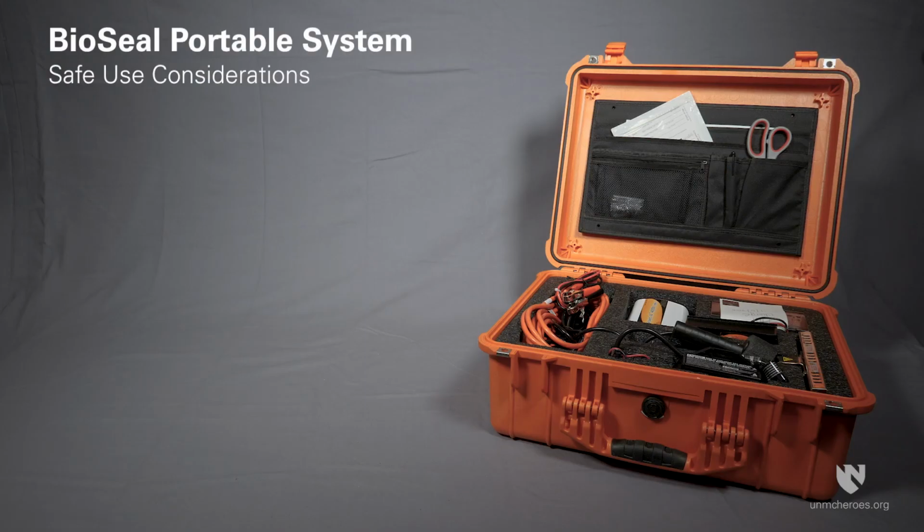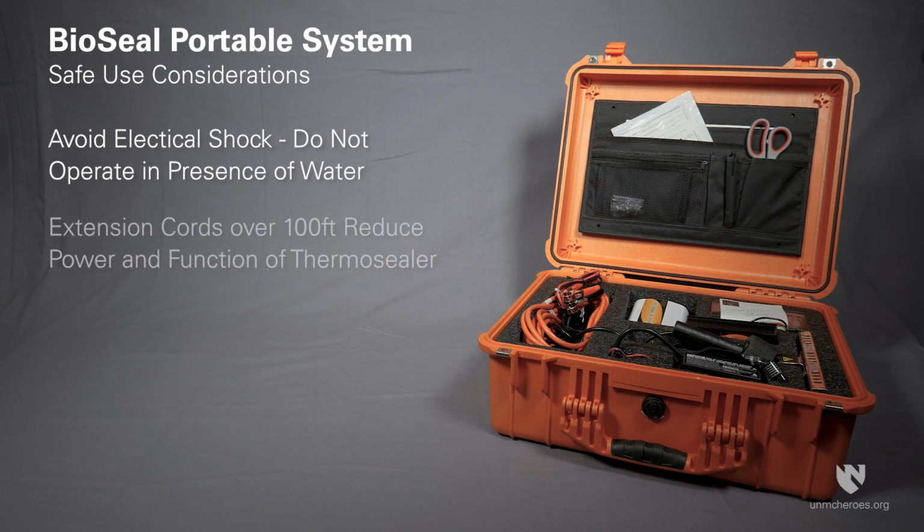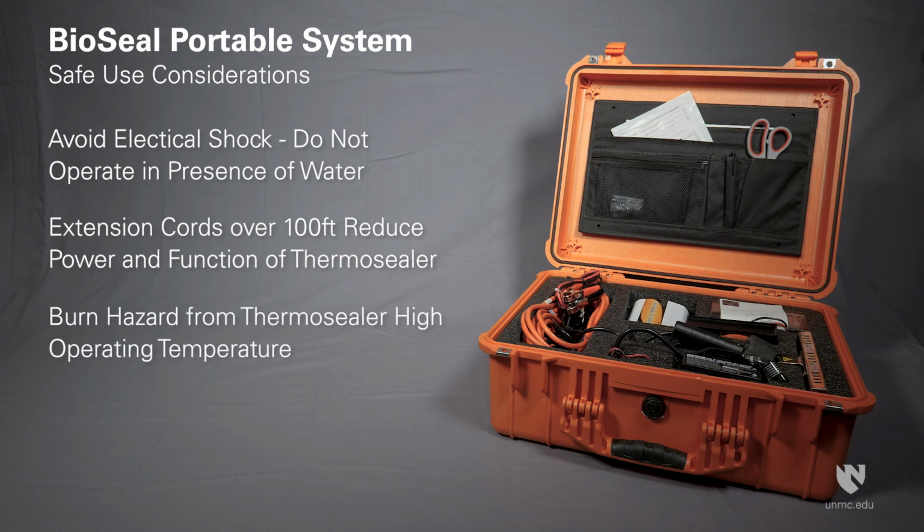There are a few things to remember for safe use of the system. Do not operate the system in the presence of water to avoid electrical shock. Use of an extension cord greater than 100 feet in length will reduce the power output from the inverter and affect function of the thermosealer. The high operating temperatures reached by the thermosealer present a significant burn hazard if used improperly.